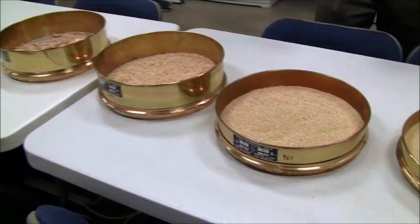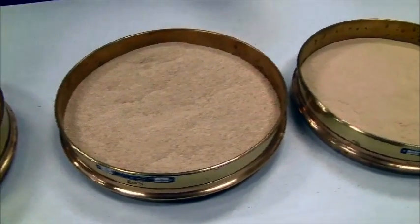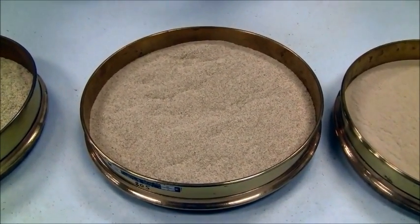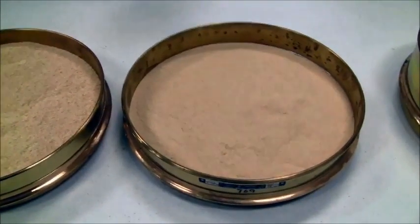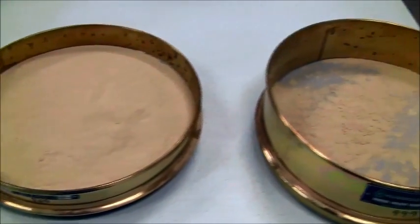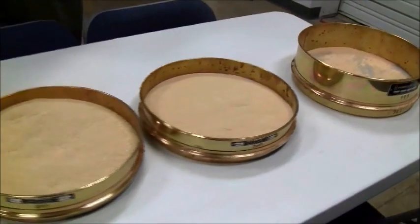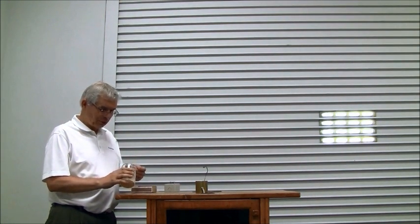If we go to the other side where we have finer dust — dust that is smaller than half a millimeter and getting eventually smaller — the smaller it gets, the bigger the flame and the bigger the hazard. Now we will show you how dangerous wood dust can be in suspension. Here I have what I would call the worst part, which is very fine dust.